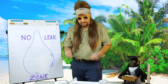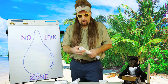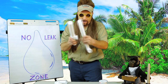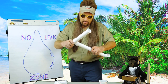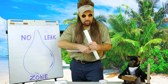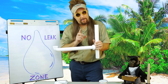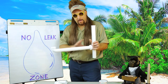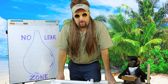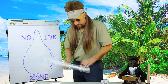The way tubular PVC connects to each other is like this. This is where all the action takes place — that little gasket right there goes right into here, and that's a little beveled edge right here. It's just as simple as going in right there, putting the gasket up there, and then tying this thing tight. Whenever you tie this, you're going to go pretty snug — but you don't have to have a wrench. These pipes are not under pressure, so you don't have to gorilla-strength this thing. There's also plumber's putty, used as a sealant in particular situations, but it should not be used in this situation here — it's not to be used to keep this thing from leaking.